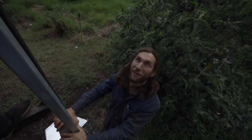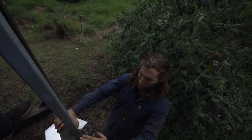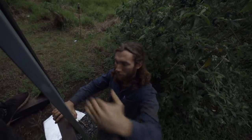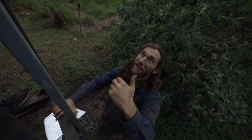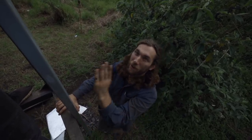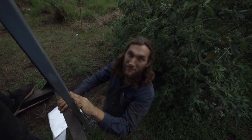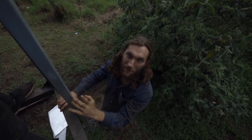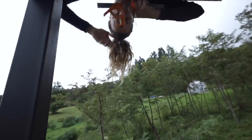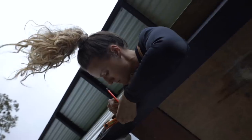This is actually really, really challenging because we have two different angles going on. We slanted this platform down slightly so all the water runs off and doesn't run in through our garage. And that's also slanted. So it's a little tricky trying to find the points where the beams are gonna go. So we have to use this as a level to get everything super straight. What are you at right now? Okay, no, it's close then, because we have 9 and 28 and a half. On both sides of the line? Just as long as it's a 20.